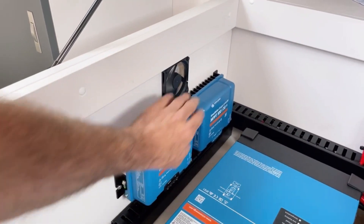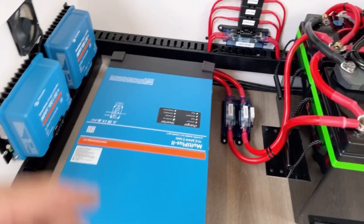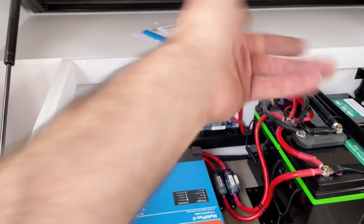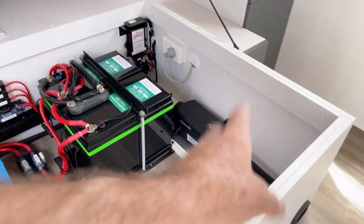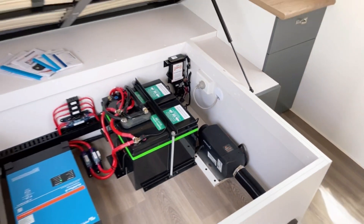There's the two solar controllers - one covering the larger array. There's the 50-amp, there's the 30-amp. There's the MultiPlus. You've got your master fuses all lined up through here, all relocated from outside - it just had ugly-looking fuses before. We've been on this job twice now - done a diesel heater, a Webasto diesel heater. Got the Wi-Fi alarm system with GPS tracking on this one.